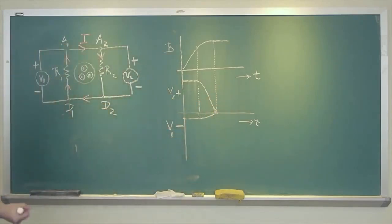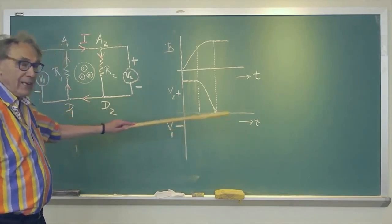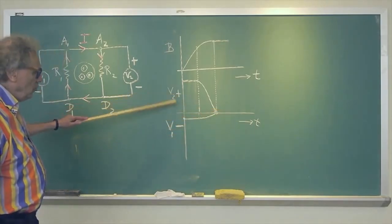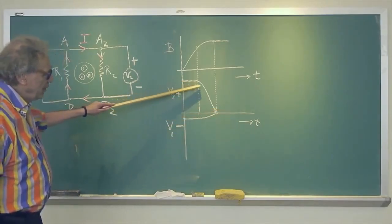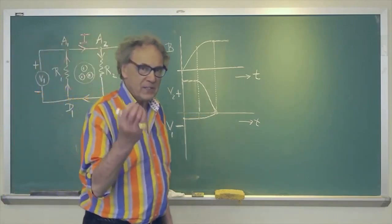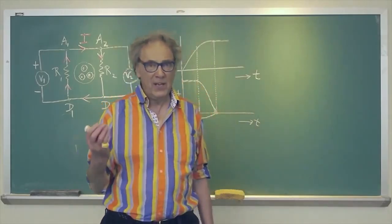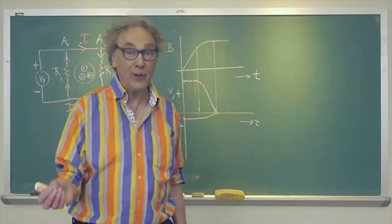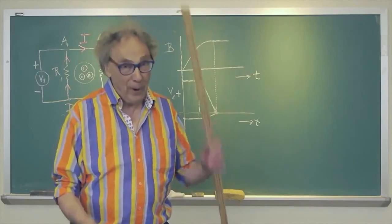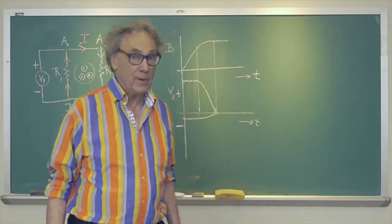And so, the moment that we turn on the electromagnet, we show the students as a function of time, millisecond resolution, V2 and V1, and these are the curves that you will see. You see in front of your eyes the fact that 1 voltmeter, in this case, reaches a 10 times larger value than the other, but also that the polarities are reversed.